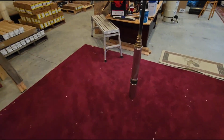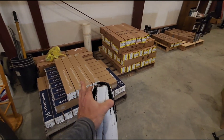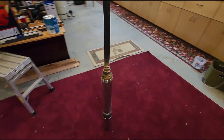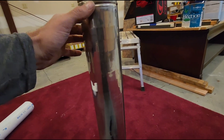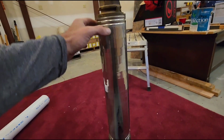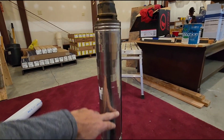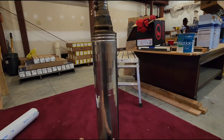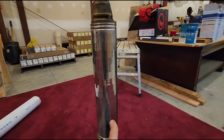We have loads of different pumps here — three inch Grundfos and four inch J-class with Franklin motors on them. If you understand a well pump, you basically have your pump stack here, and every indentation on this is an impeller. So this would be a 16-stage impeller — there are 16 little propellers inside that get spun by a center shaft and send water up and out. The more stages you have, the deeper it can pump or the higher volume it can push.